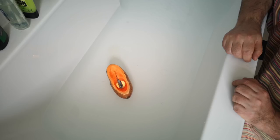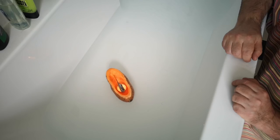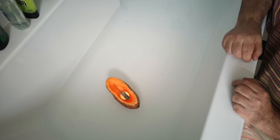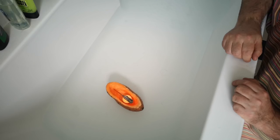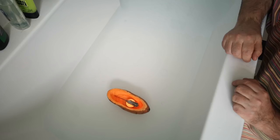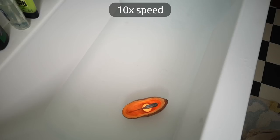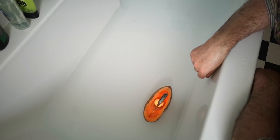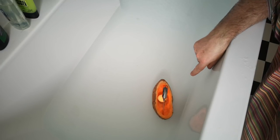Oh, I can see little ripples happening at the back. And here we go — yes, we have propulsion! It's not what I would call energetic, but that boat is now moving on its own. I think I may have actually used too narrow a gauge tube there. I used three millimetre outside diameter tube and I think that might just be a little bit too thin, probably impeding the flow a bit. We are getting a tiny little bit of thrust — I can see ripples on the surface of the water and that engine is pulsing.